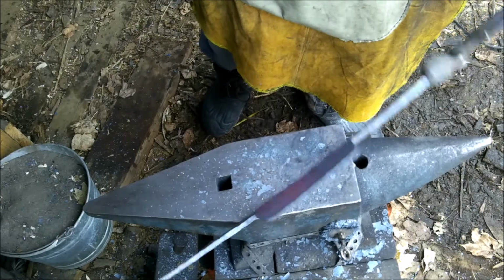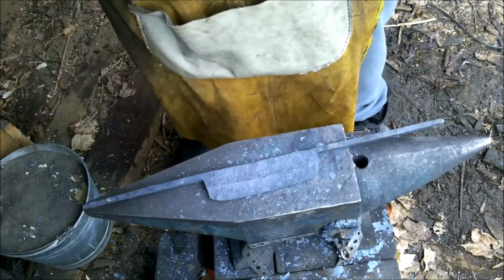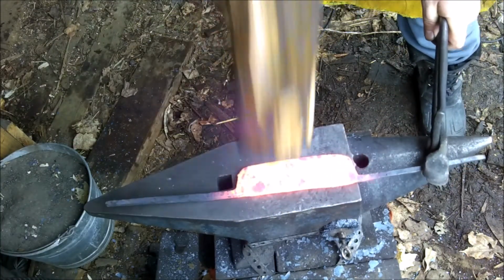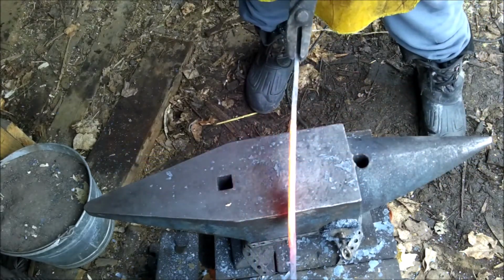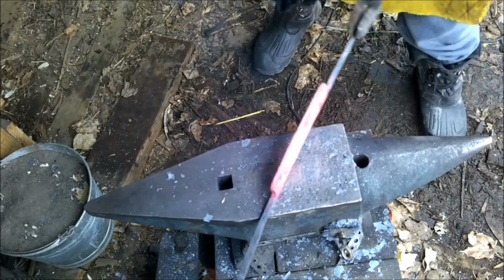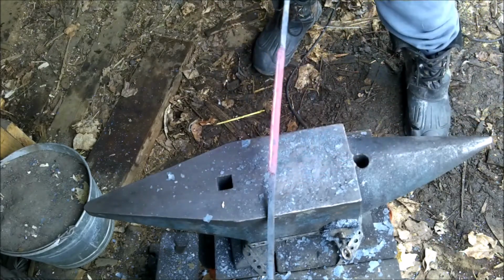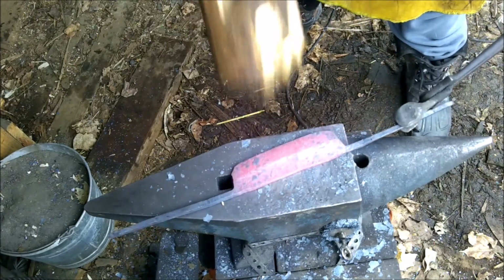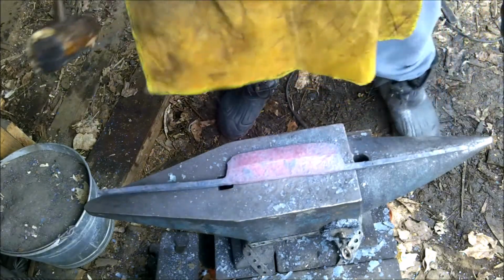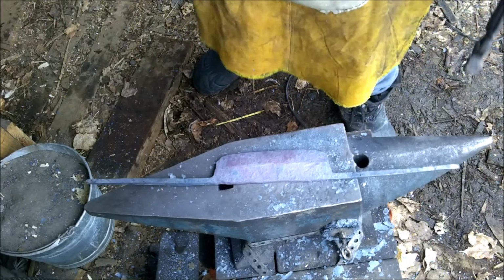We're going to straighten it, and that'll be the start of our thermal cycle. We'll straighten it, and then we'll just leave it set until it's cool, so you can see at least one thermal cycle. So, lay that flat. There we go, that's nice and straight. So all we're going to do now is let this cool a big chunk, and then we're going to heat her up again. And we do that 3 times.